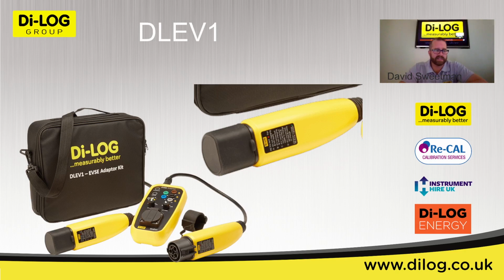And position C, which is the more common one that you'll see for charging as well. So this is EV connected, non-vented and ready to charge. So this in effect will be the signal the vehicle will say, thank you Mr. Charger, I would like to receive some charge please for my batteries, which are depleted at an expensive rate per kilowatt, I'm sure, if you use one of these rapid fast chargers out there as well.